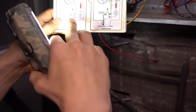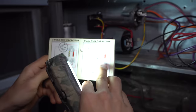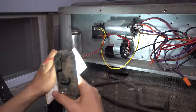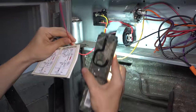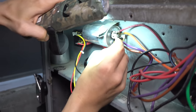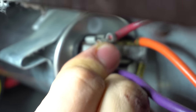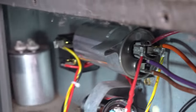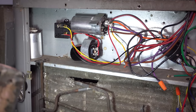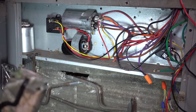Lastly, we have our red wire, which comes from terminal 1. That goes to the start capacitor, and then from the start capacitor it goes to the common on that dual run capacitor. So that goes right into the start capacitor, comes out from it, and goes to the common — which is right up here. We'll plug that in here. Voilà! We got our hard start kit put in — the 5-2-1. Optimally, after you're done, you do want to take a zip tie and tidy it up a little bit so you don't have wires loose all over the place. And your install is complete.